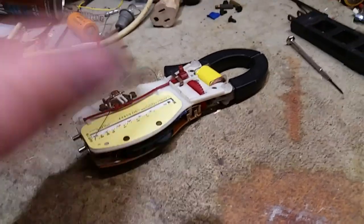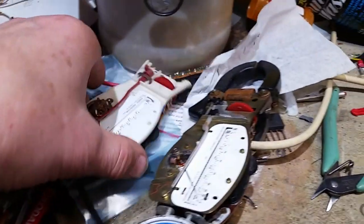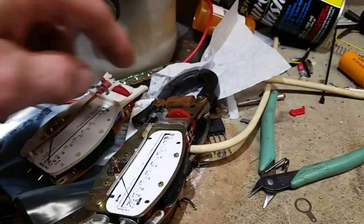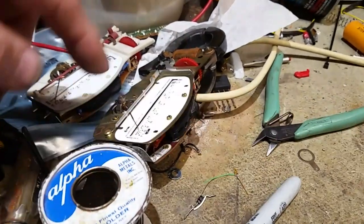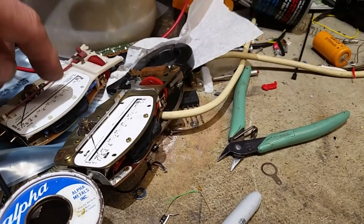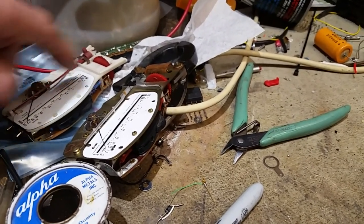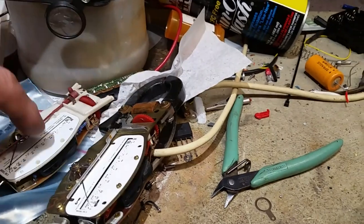I ran out of space on my SD card just as I was finishing up, so let me give you a synopsis. One is good - it was out of calibration but was probably fine before I opened it up. This one has a sticky meter which I can swap out from the one that's dead electrically. Another one has an intermittent connection that a jumper wire fixed. I may try to get a fourth working by swapping electronics from the dead unit. So I should get at least three good working amp probes: one, two, three.